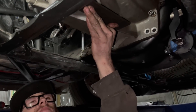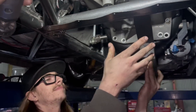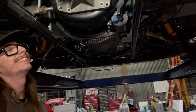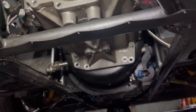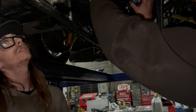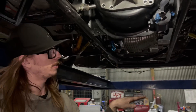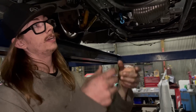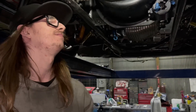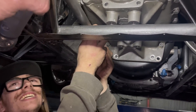The plate is straight all the way out. You can weld a flat plate on top of your two tubes, do whatever you want, and continue what we were doing. You could do a plate, cut a tube in half — smaller than the tube you had — weld the halves on the bottom, and then it would slide in your channels just fine. It would fit in this gap. Either way, you've got to get some sort of tubes on these up in here.